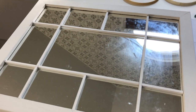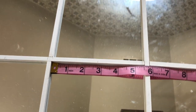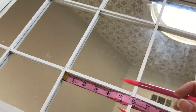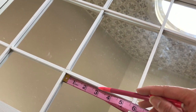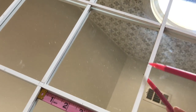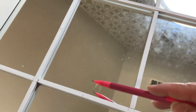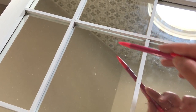And then I just kept cutting and adding more to the frame. Now these are not glued as of yet. Now, since this was a smaller mirror, I could only do two diamonds in the center. So what I did was I measured out each center of the inside squares. This is where the diamond corners were going to touch the frame, and I made those marks on the dowels, as you see here.